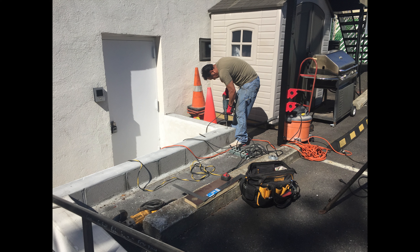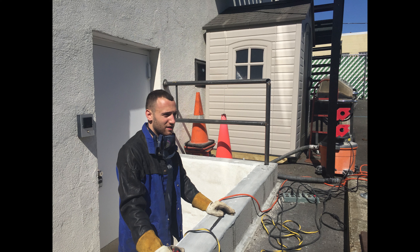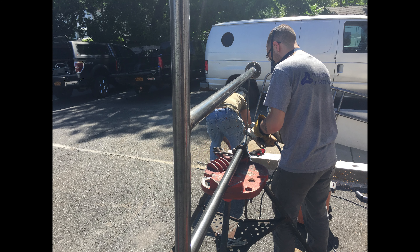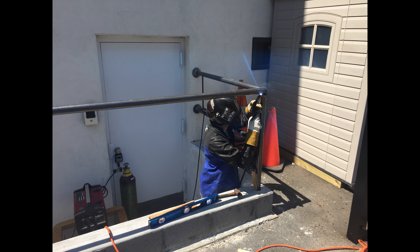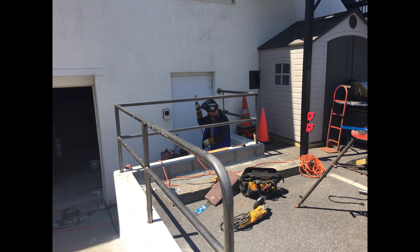We started by drilling some big holes in the concrete, and then these pipes were to get cemented into the concrete wall. It was really hot that day — almost 90 degrees. I brought a pipe vise out to do some of the prep and welding. Here it is starting to come together: mounted to the wall, pipe in, leveling things out, welding it together, and getting that crossbar on.